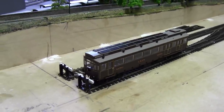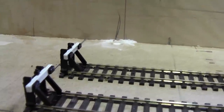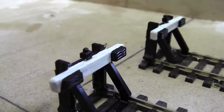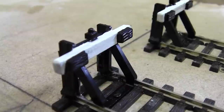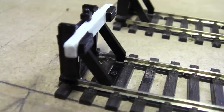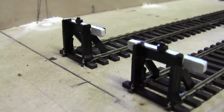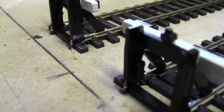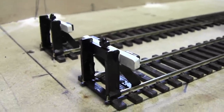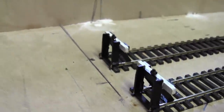So what have we been up to? If we just come around this side, I'll gently move the rail car away. You can see I've added some buffers to the end of the tracks here, and there are some LEDs fitted to the tops. I have done videos of fitting LEDs to buffers and it's quite simple really. These are the red micro LEDs and there is a resistor just there before it goes onto the track — you can't see it because it's painted black to blend in with the buffers. Once the track is painted the buffer frames will be painted differently.